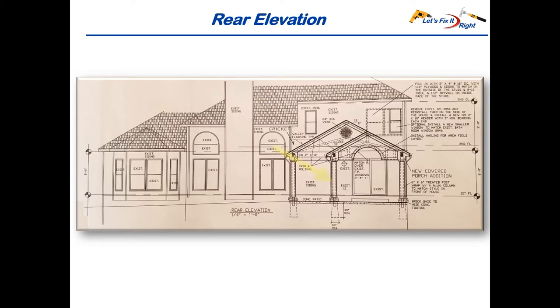Six by six treated columns with decorative aluminum wraps, which match the columns on the front of my house. Footings, which are also included in several other drawings. Additional concrete for the enlarged portion of the patio. The front arch. Dotted lines outlining the scissor trusses with seven-twelve pitches on the top and three-and-a-half-twelve on the bottom. This beam consisting of three two-by-tens and half-inch plywood. A cricket valley roof line, which I will build in part four's initial construction and framing. A vent above the center of the large arch, and the removal of this window, which the county building inspector later allowed me to cut in half rather than install a brand new one.